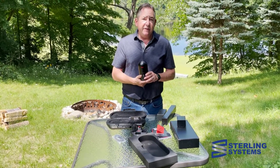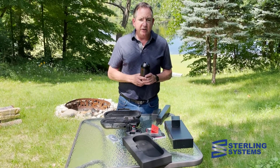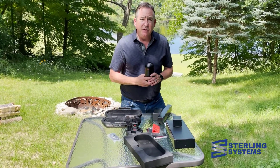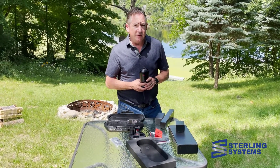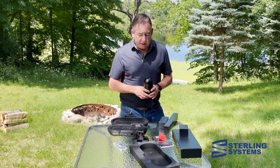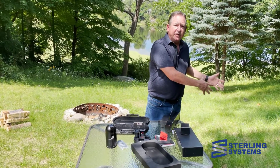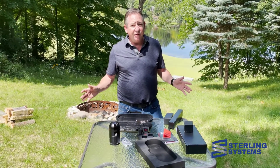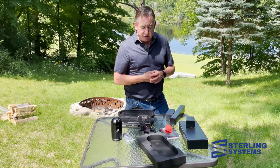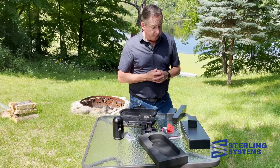It now has five-bracket HDR photos, so very high quality imagery — that feature comes from the RTC360. It also has the VIS system, which I can't believe they put in there, also from the RTC360. VIS stands for Visual Inertial System, and what that allows us to do is set up, do a scan, pick it up, move it to the next scan location, and the moment we set it down it's pretty much already registered — it knows the relational change between the first and second setup.